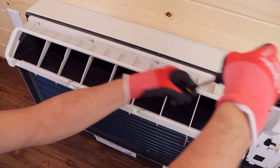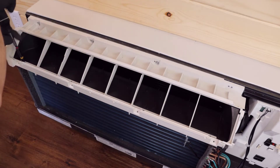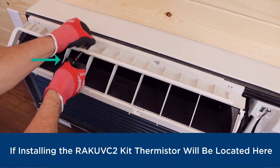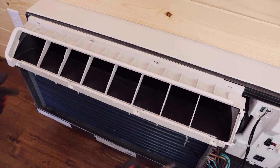Remove and retain seven 5/16 inch screws that secure the air outlet deflector. Note: models that require the RAK-UVC2 kit will have a vent thermistor attached and will need to be temporarily removed. Set the deflector aside.